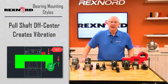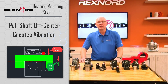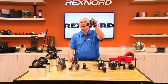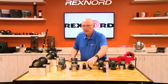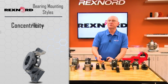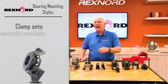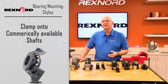In order to fight the vibration and the off-center condition created by set screw or set collar, we can go to either a clamp lock style or a tapered adapter. If we want to jump up in performance, we might consider a clamp lock. Clamp lock uses a concentric collar and an inner ring that has slots in it. As I tighten the collar concentrically, I squeeze the inner ring centrally over the shaft. If I clamp centrally, that means I have very good concentricity. Very good concentricity means no vibration. Clamp lock is easy to install, great concentricity, low vibration, and has great capability to go onto undersized shafts. With a clamp lock, you're able to clamp on shafts that are commercially available — that could be up to five thousandths undersized depending on the shaft size.